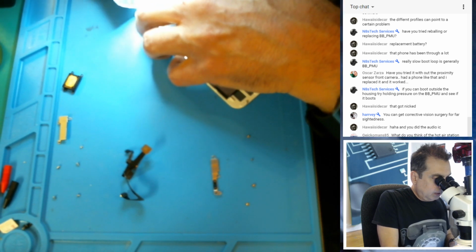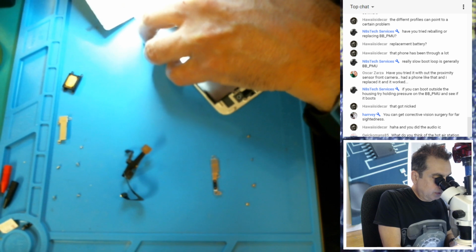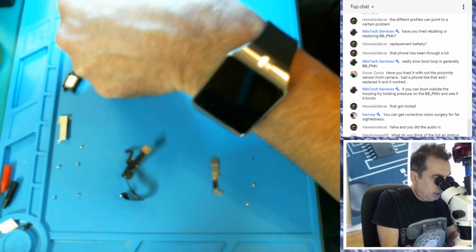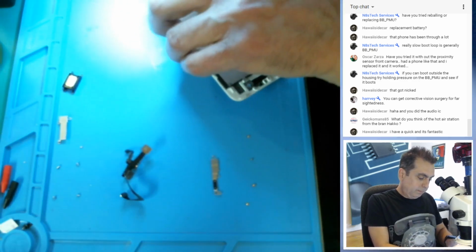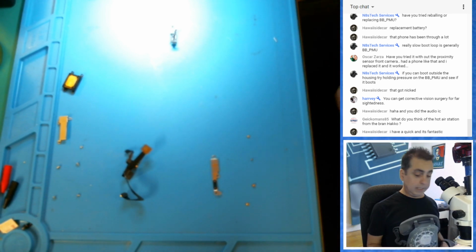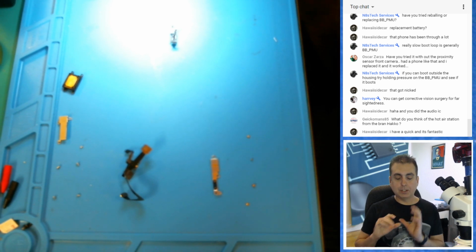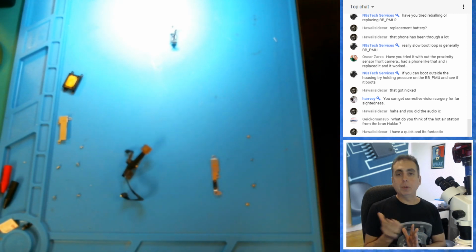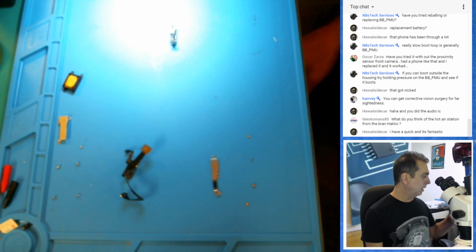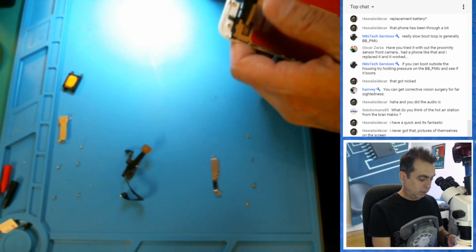By the way, guys, if you were here when I was talking about the iPhone 8 Plus that would not boot up, that one's still not happening. That was the one where I had to order the Hydra and the Tigris IC, and unfortunately that did not solve the problem. It will boot up and it shows connect to iTunes on the screen and it won't update. It shows it's going through the update. It says congratulations, your phone is updated, everything's fine. The phone reboots, and when it starts, all you get is a black screen with iPhone is disabled on the back. So as far as data recovery on that one, I think they're going to be out of luck unless we can come up with something else. I think that's pretty much a wrap, though.